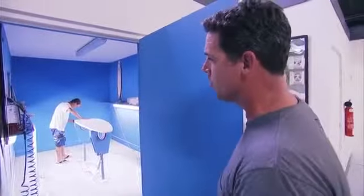After it comes out of the computer, it goes into this room and this is where the human adds the magic. As you can see, Mark Phipps here is working on his boards now. When you're working with a team rider like Jeremy that we work with consistently, you can get down to really fine details — within millimeters — just altering bits and pieces, thicker or thinner rails, different rockers, and really fine-tuning the board.